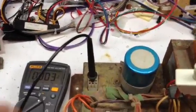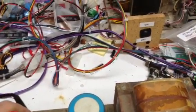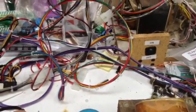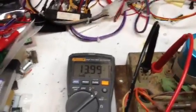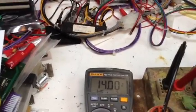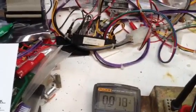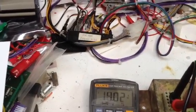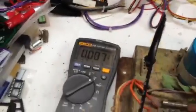I like to use pin 5. When you go into test point 1, what you see on the meter is 13.99 volts DC. That's very common — you'll see upwards of 14 to 15 volts because it is unregulated. Then you go into test point number 2 — same thing. Number 3 the same thing. You can use whichever ground you want, whether pin 4 or pin 5.